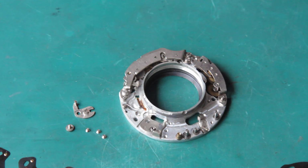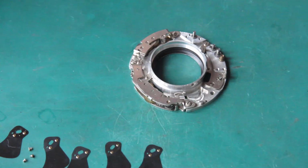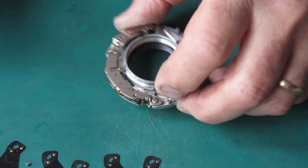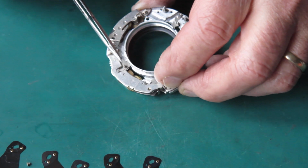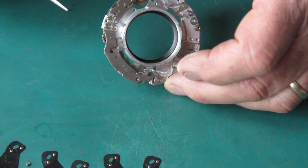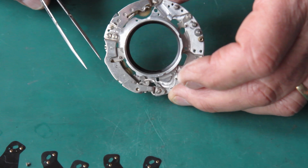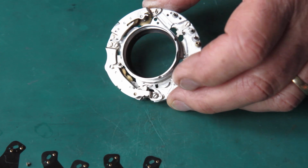it'll be possible to reassemble things and make a working shutter of it. I have all these components clean now. Everything's been flushed out. The speed trains I've flushed out with naphtha. Put in plenty of naphtha, work the speed trains repeatedly, blow all the naphtha out with a blower, and that's so that any oil or rubbish that the naphtha has picked up, you blow it out, you get rid of it, you blow it away from the shutter.